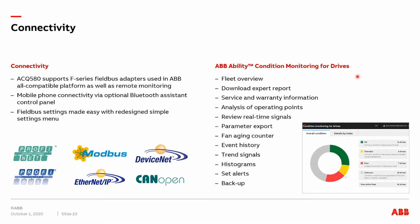The one system that we did is we actually just used the normal ABB HMI. We used the ADSL router. Then an address was set up with that, and one of our engineers said, I could actually control the drive, I could start and stop the drive from my mobile, wherever I am. If the drive trips, we would be able to see what the drive tripped on, and we could reset it. So that is an extra engineered solution. It is available, but we'll also add more information onto the webinar on this, so that you can have a look.